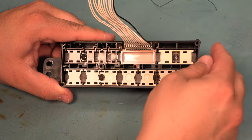We'll put the foam square in place. We'll squeeze it with the plastic tool. We'll slide the filter keeper into place. And the new foam is in place. We'll do that on number 2. And on number 3. And on number 4. So that's what it looks like after we replace those filters.